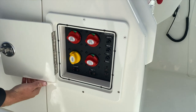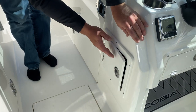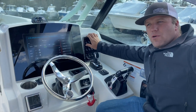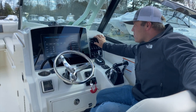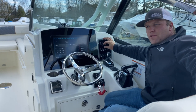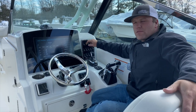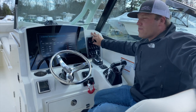We're going to flip the house back on and move up to the dash. Starting at the top left of our switch panel, we have our horn. Coming one over, we have our nav lights — up for running at night, back for anchored at night. Middle position is off. I get a lot of dead battery phone calls; nine times out of ten we go out to the boat and the switch is left in the down position — the mast light was left on.